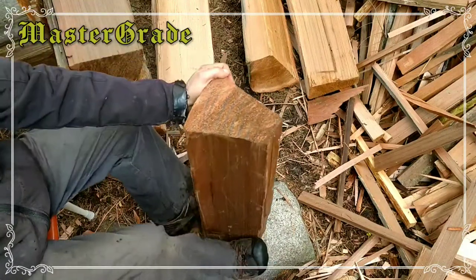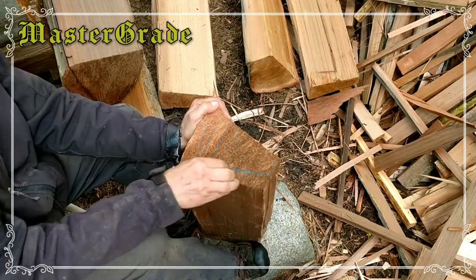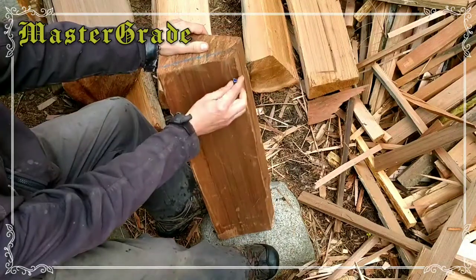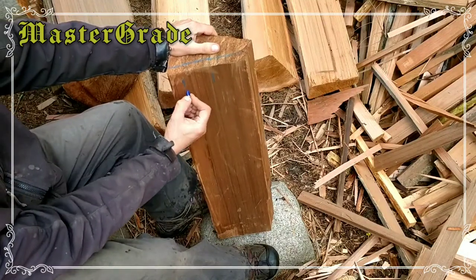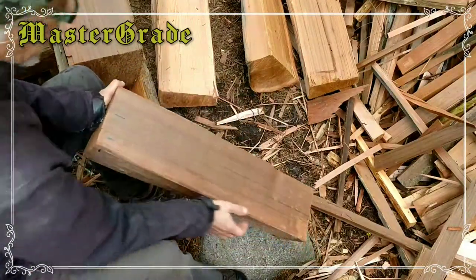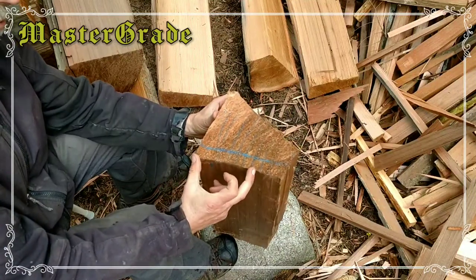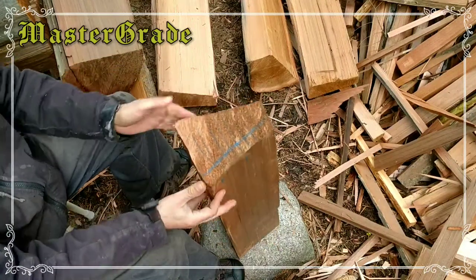In order to cut shakes off of here, we want to estimate roughly half an inch thick. That's called edge grain — we'll be going against the growth ring lines. There's probably about a hundred years here, and probably two hundred years there, so over two hundred years just to make a block this size. Typically a shake block is 24 inches long, and a minimum width of a shake might be four inches — you don't want a block too small as it just ends up with a lot of small shakes.